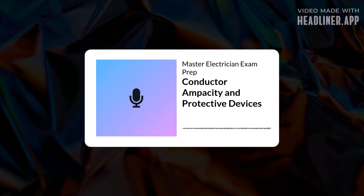So it allows for slightly smaller conductors than you might otherwise calculate for a 200A load. Generally, yes, for those specific dwelling unit applications up to 400 amps. Over 400 amps, the standard calculation methods usually apply again. Got it. Now here's something you mentioned that sounds critical. Terminal temperature rating. Hugely critical, often overlooked.